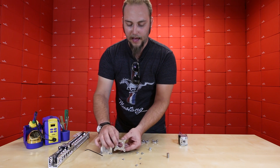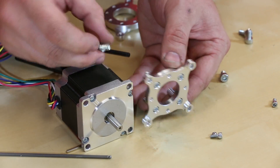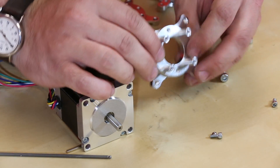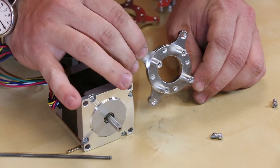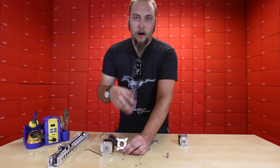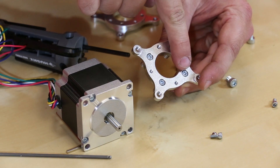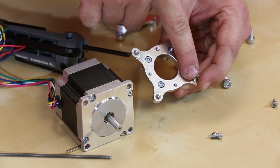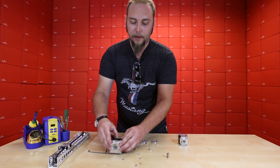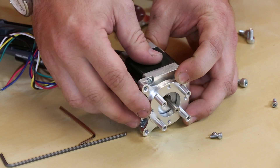It's really as easy as that. The bracket just fits directly on the front of the stepper motor, and then you use the included screws to bolt through the back of the stepper motor into the mount. The mount has the Actobotics screw pattern on the front of it — the screw pattern that fits the outside holes on the Actobotics pattern. They've cleverly countersunk the heads where the socket head screws are going to go on the back of this bracket, so you can put screws through the back, bolt it to the front of the stepper motor, and you don't have a clearance issue between the top of the screw and the front of the motor assembly.